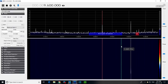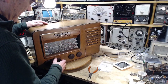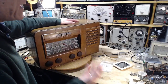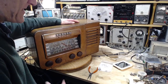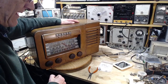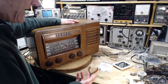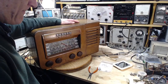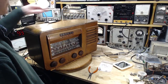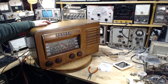It's never even crossed my mind that you could have a local oscillator sensitive to - I'm going to guess it's the AVC voltage that's fiddling around with the oscillation of the local oscillator. I think it does because anytime we have something coming out of the IF, the local oscillator seems to shift. So this has to be considered a really critical design problem. I'll bet you this is one of the main design problems that radio designers face: trying to get a local oscillator that sticks where you put it and doesn't wander around as other things happen with the radio.